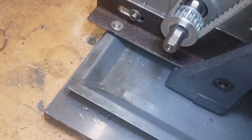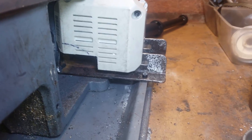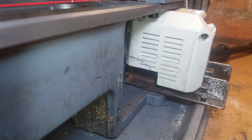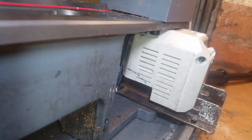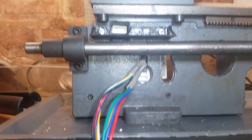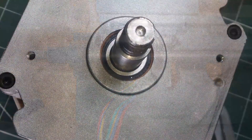You can see my bracket there — if we get a sneak look inside, I'm very happy with that. It's really stable. There's another bolt through to the engine further along the base, and also a bolt right at the back bolting the rail to the lathe chassis. On the other side there's another nearly identical bracket. I've also put the fan back on — there was a plastic fan on the end of the motor spindle — and butchered the cowling a bit to create some kind of wind tunnel. The wires are lining up really nicely with the slot where they come out of the back of the motor.